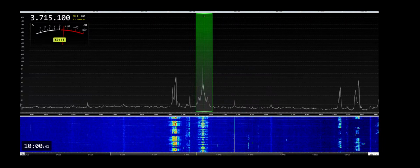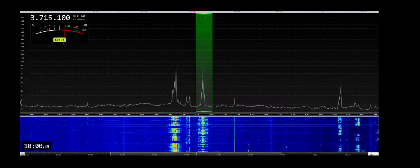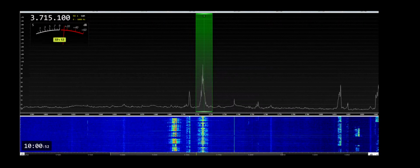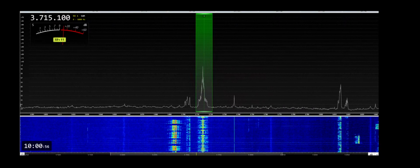And it's absolutely weatherproof. The tuning does not change one iota. And I used to use the window line, and I'd have to retune it as the weather, the wetness of the line changed. So that's one suggestion.